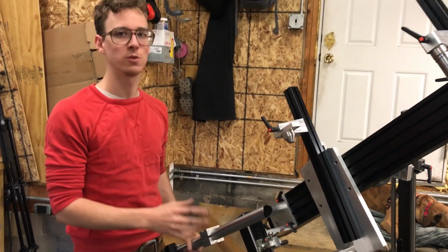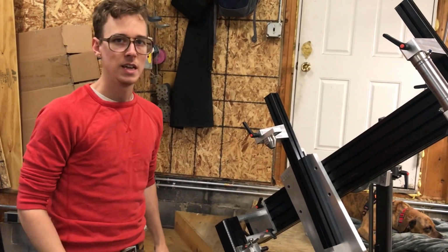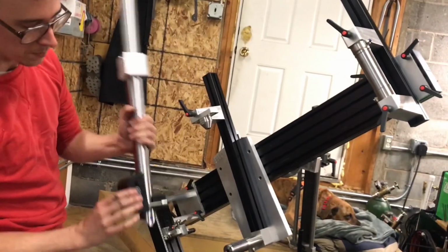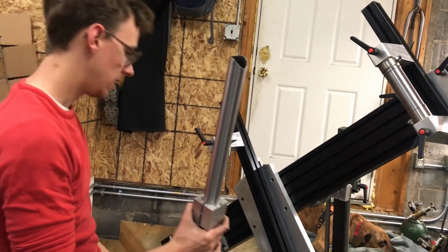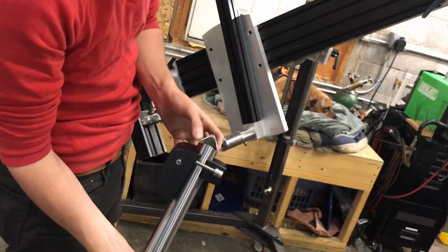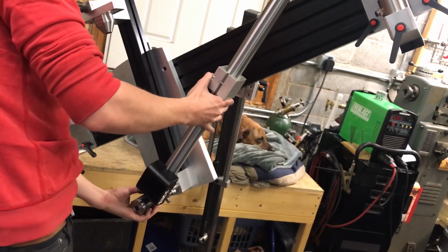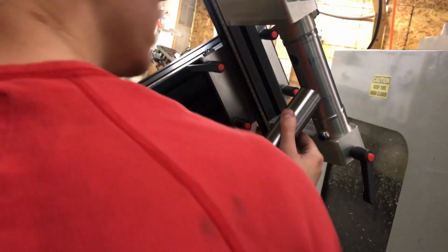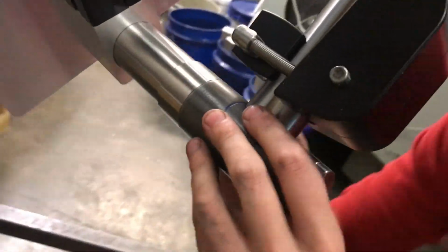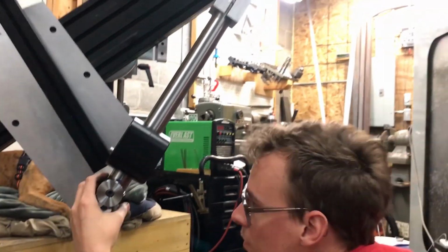I love these moments when something like a boring old tube turns into part of the structure. I can actually just keep the Miter Daddy clamped on how it was, and this Paragon block clamped on how it was. And what we do is we use this notch here. I didn't even deburr this yet. I just set this on according to the guides, the little scribe marks that I put on, get it centered, and then I drop the tube in here. And how are we looking? Is it centered up? It's a little bit, okay, so that's about centered up there.